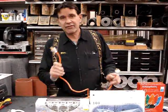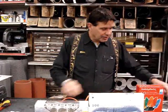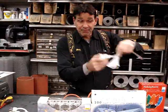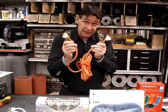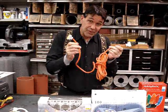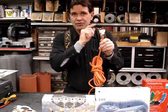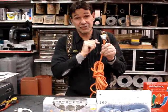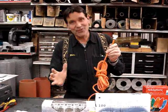First of all, don't ever run your Christmas lights backwards so that you end up with a female cord at the house and you can't plug it in, requiring you to go get a double male cord so you can plug it into the wall and into your lights. Very dangerous. If you plug this in the wall, this is live 110 volts electricity outside in the snow, very capable of causing serious damage to someone. So no double male plugs for any lighting.